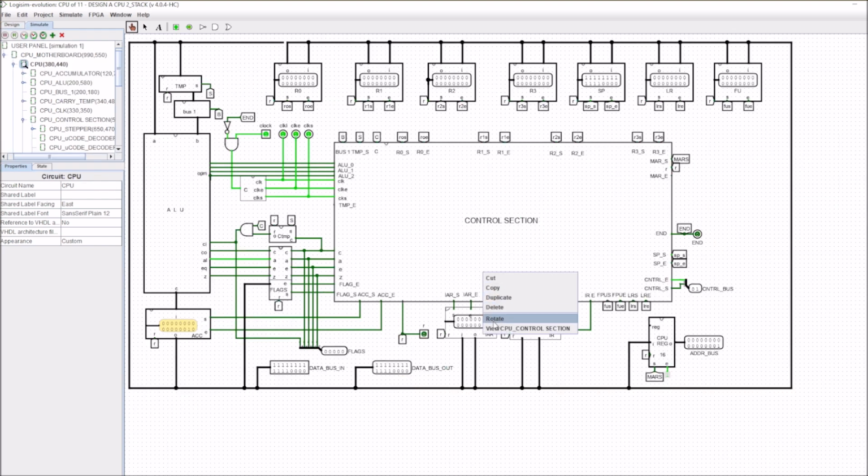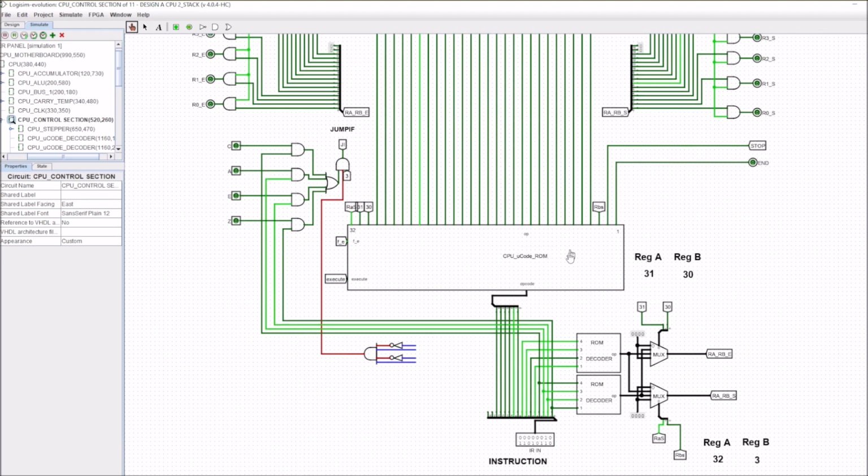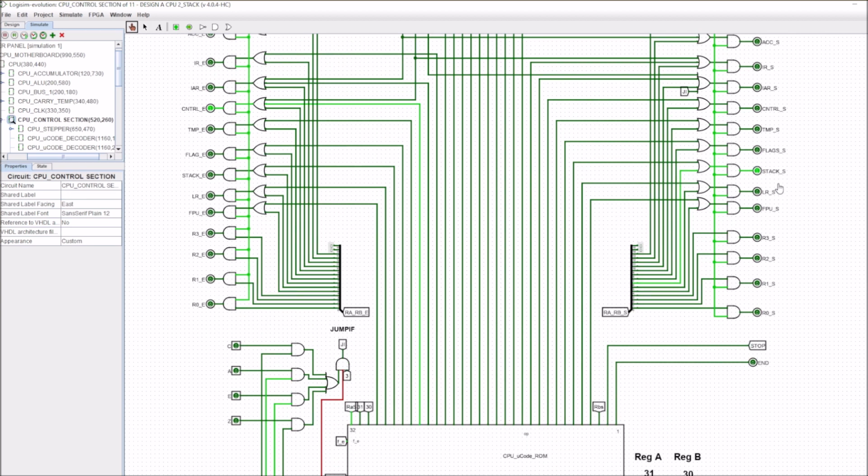So when we're at that stage 2, if we drop down into the microcoded, well, leave it at that point at the moment, you can see here that reg A is going to be set. So we come down here, reg A set, so this one is set. It means that it's going to be passing from reg A, which is this one here, and it's going to be passing the set value down here. So that's reg A, reg B set, and then you see the set value get passed down here, and it's choosing this value here because that's what we've told it to do from the 4 values here, 1, 1, 0, 1. And we've told it to come up and choose the stack. Okay, so that's forcing it to choose the stack here.